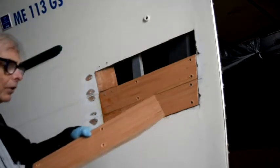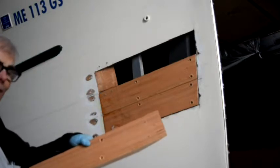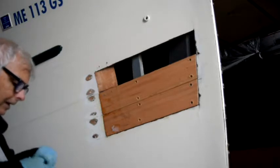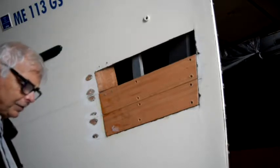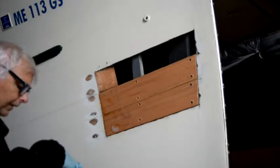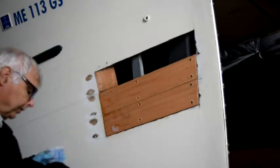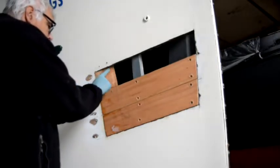At this point I'm ready to put some epoxy on the scarf joint and put it together. Here's the plank end I'm going to install. I've pre-drilled it for the drywall screws that I'll be using to draw the parts of the scarf together. Those holes are just about in the middle of the scarf. So the first step is to coat both faces of the scarf with unthickened epoxy — West System 105 resin with 205 hardener. I'll put an abundant amount on and let that soak in for a little bit, and the same up here on the hull proper.